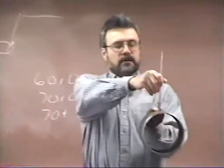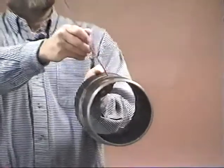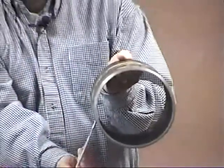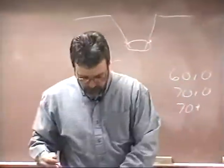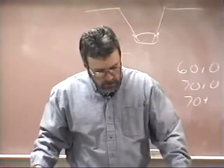So as you're going around the pipe, he's talking about this straight up and down, so we're going to be holding it about like this in relation to the pipe all the way around. So you're always holding it into the face of the weld as you're coming around. Very important. Incorrect rod angle has failed more people than anything else. Okay, read the rest of page 117.